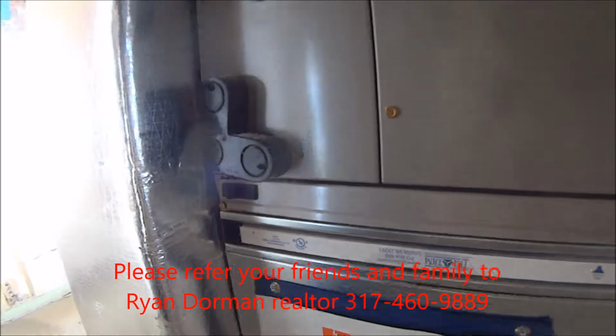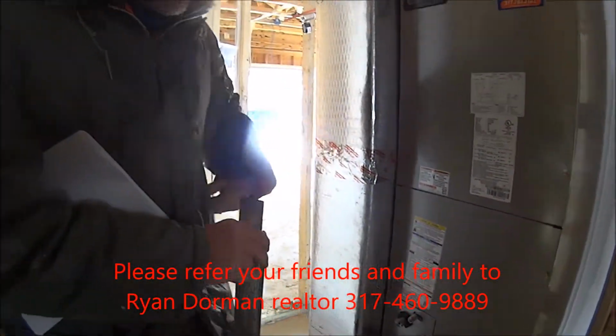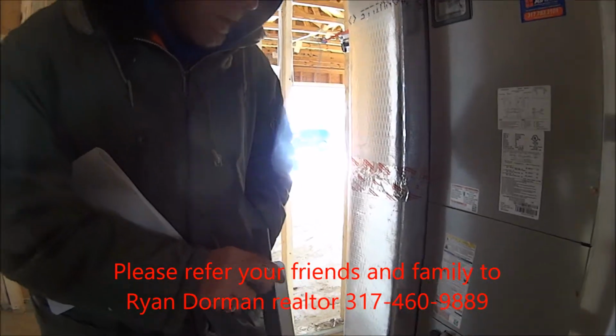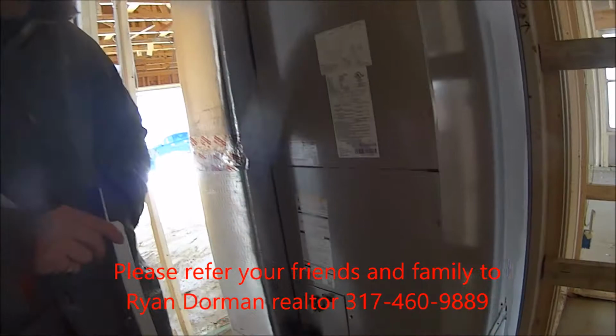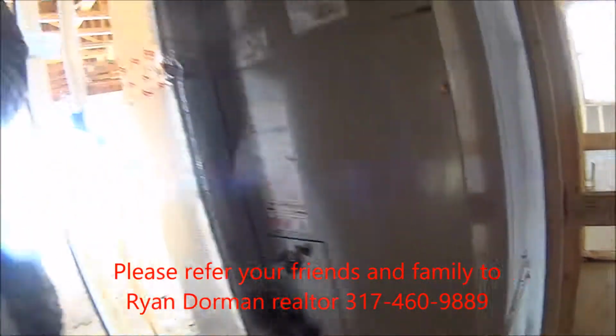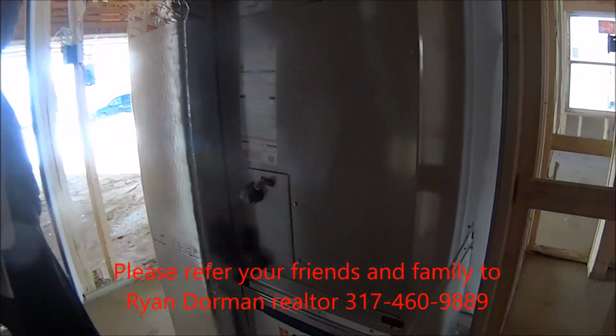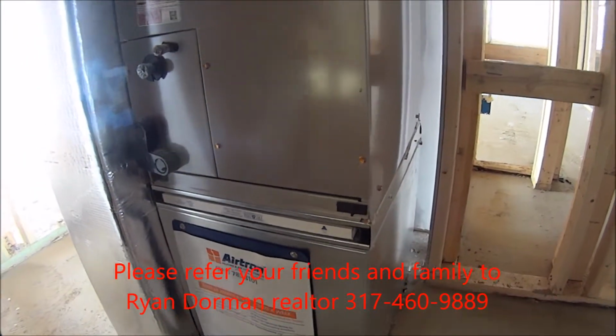There towards the end, we do come back and clean or check the furnace, make sure it's at the right temperature and everything. At that time, they will put a little sticker down here that will tell you the size of your filter, which is a 16 by 20 by 1 inch. And then it'll have a little blue arrow on there too that you want to make sure that arrow and the arrow on your filter is flowing the same way.